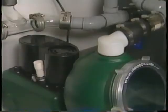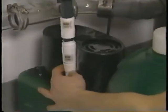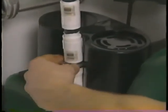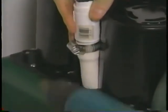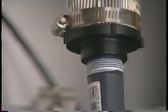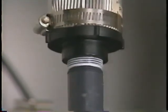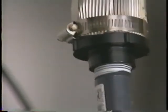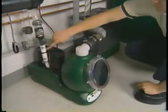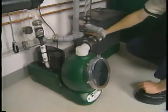At the rear of the Rhino unit, you will see the pump outlet pointing straight up. You'll need a one-inch threaded plastic nipple. One end of the nipple is inserted into the pump outlet and secured with a one-inch hose clamp. The threaded end of the nipple is screwed into a one-inch to one-and-a-half-inch female-to-male adapter, threaded to glued. Wrap the threaded joint with Teflon tape. One-and-a-half-inch piping or larger, as required by site conditions, can then be extended to the building drain.